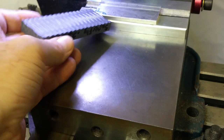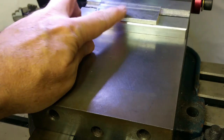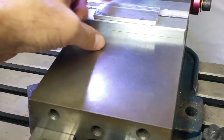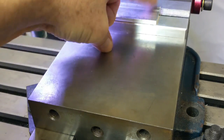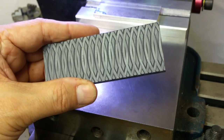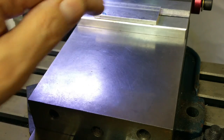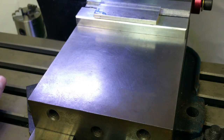First I'll run it slowly to flatten it, and then I will go back and do a step and repeat. The first time across it'll produce a scalloped, gill-shaped pattern — just little semi-circular cutouts. But the interesting thing happens when the backside catches it and makes the pattern in the opposite direction — that's when you get this swirly diamond kind of interference pattern. This could be very useful if you have a manual mill instead of a CNC mill and you want to get complex tool paths without CAD, CAM, or CNC. You can just do a quick step and plunge, advance, plunge, advance — very easy to do on a milling machine manually. Although CAD would be helpful because a lot of this is trial and error, and CAD can be very helpful in visualizing the interference pattern that arises.